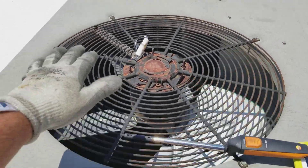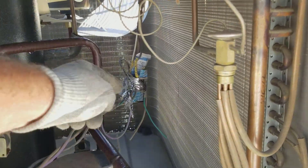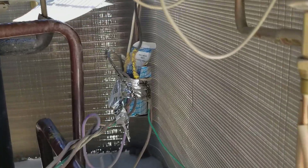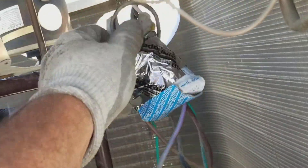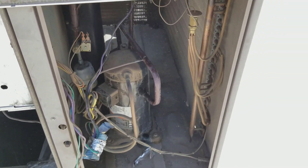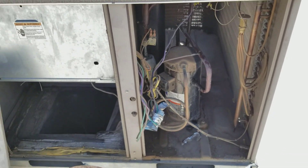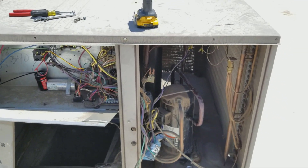The run capacitor wiring is a mess. These idiots don't know how to wire a motor back as three-wire, so they think they need to use all four wires - both browns going to the capacitor. They don't know to cut off the brown wire with the white stripe and just run the other brown wire all the way back as a home run to where the capacitor goes. So you end up with the capacitor hanging down underneath the fan like a hack job, like most of the Texas service centers do. They get paid by the job and that's the crap they'll do - it's horrible.